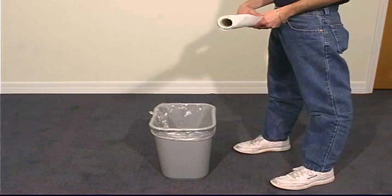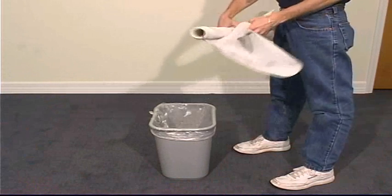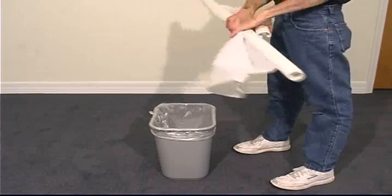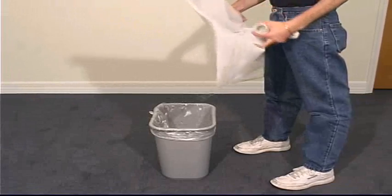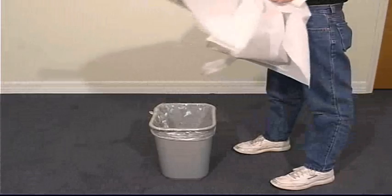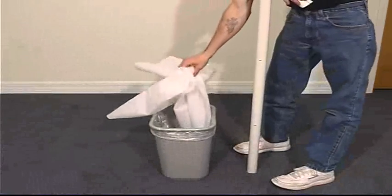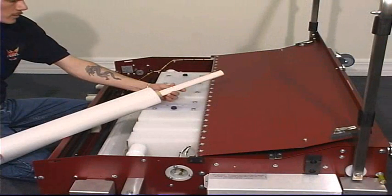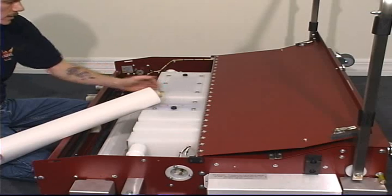With the old cloth out of the machine, it will be necessary to unwind it off of the PVC take-up reel until you get to the retainer clips that are on each end. Once the clips are off, unwind the rest of the cloth off of the two metal screws on the PVC roller. Before installing the new cloth, please remember to put the PVC stabilizer bar back inside of the roll.